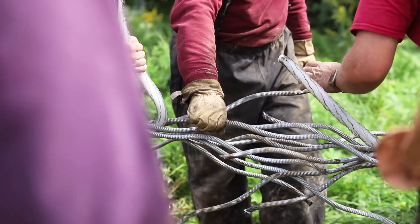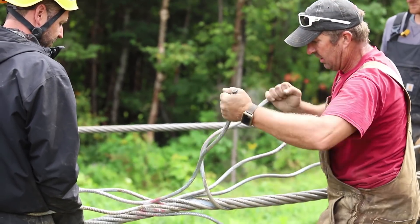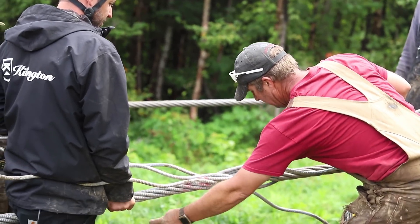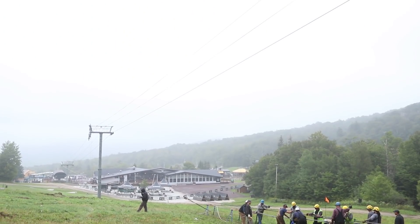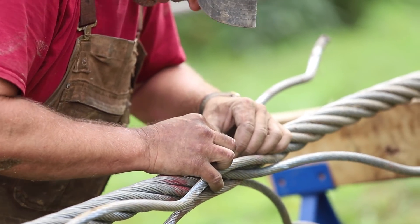After we've installed the new rope and have the two ends of the cable laid next to each other, we take three strands from one end and three strands from the other end and wrap them together to form a single loop of the haul rope. This haul rope has a splice that's about 200 feet long. The minimum splice for a lift this long with this size haul rope would be about 135 feet, but we leave room within the splice so that as the rope stretches, we can take more rope out and do what's called a re-splice to shorten the overall length.